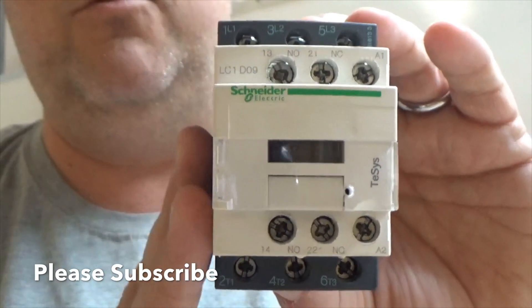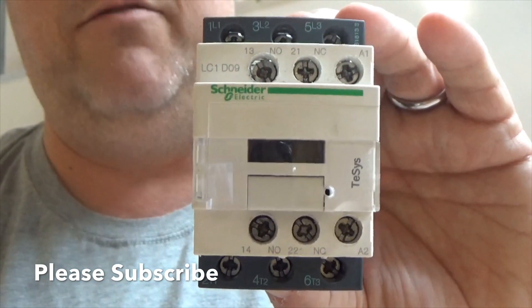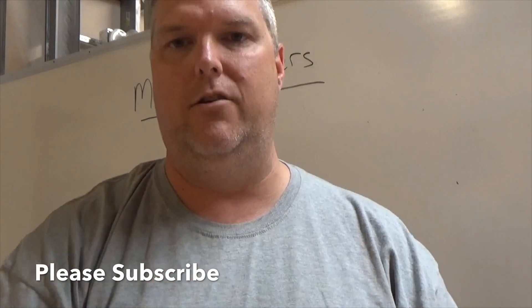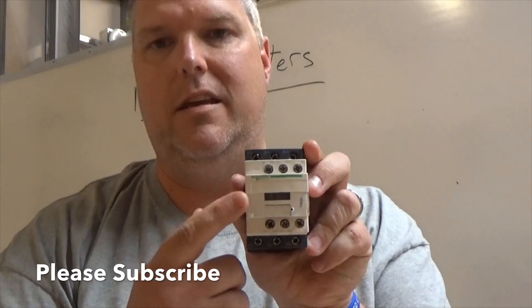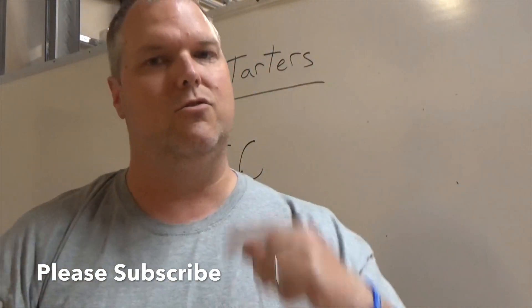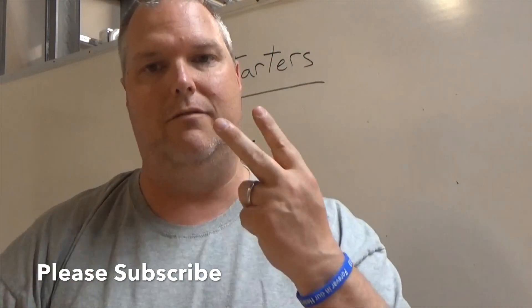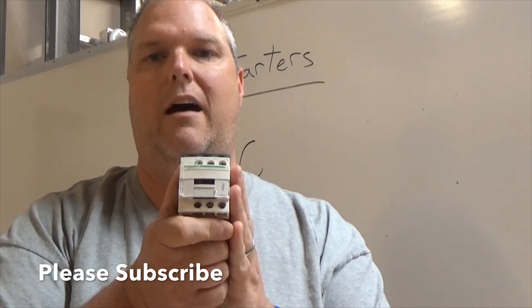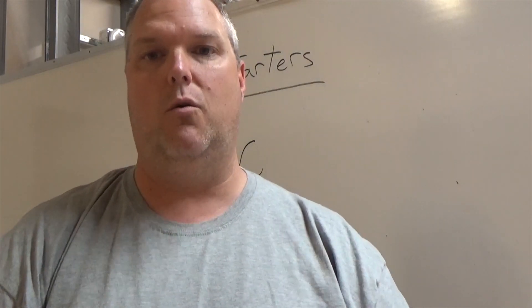What we're trying to figure out is how do we wire the motor starter? One of the things we have to remember is a motor starter has a coil in it, and that coil pulls in when we give it power — when we energize it, it pulls in. The IEC has built-in normally open and normally closed contacts. There's only one normally open and one normally closed, so we only have two sets of contacts. We can hook up lights to this, and we also have what we call A1 and A2, which is kind of like our pin 2 and 7 or 2 and 10 when dealing with an 8-pin or 11-pin relay.